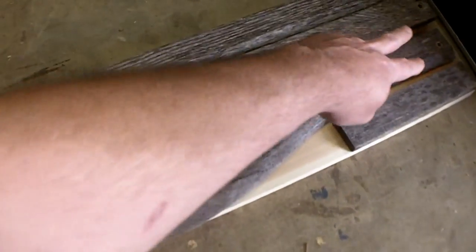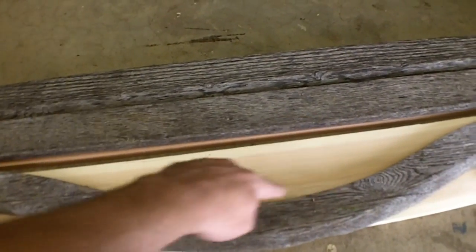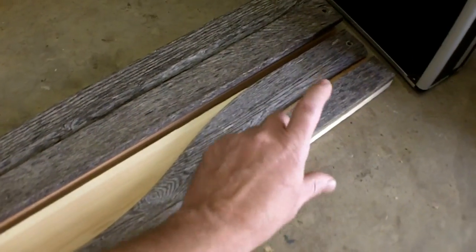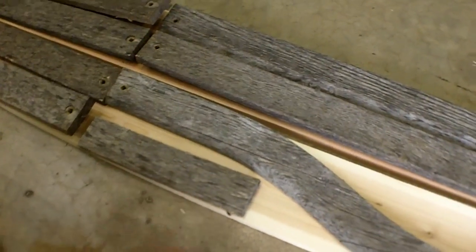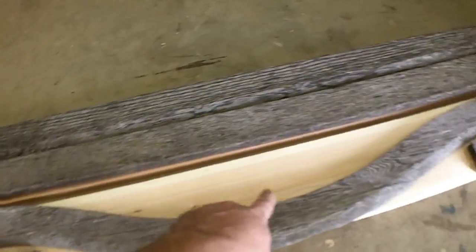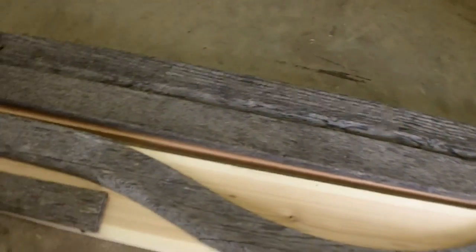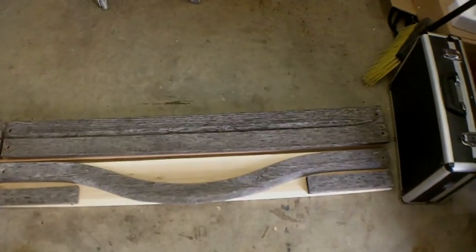You can see how I'm going to do this. I'm going to take this section out and cut this piece. This piece will come up here to make the top of the arch — it'll be a glue-on. The risers for the slats will come out of these little sections here. When I lay this out, I'll just scribe around this leaving it a little proud, jigsaw my scrap out, and then repurpose those scrap pieces. By doing it this way, I'm maximizing my potential and minimizing my waste.